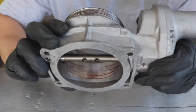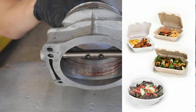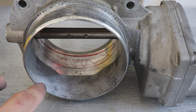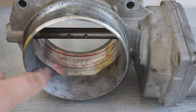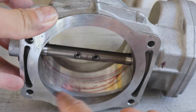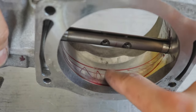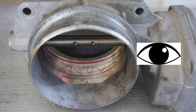Same thing on the top here. Anything in between those lines we can't touch, but anything outside of those two lines we can smooth out with the Dremel. The main areas of concern are these transitions — I can feel by hand that this right here is the biggest transition, and we're basically trying to knock that down, as well as these transitions on this side. Remember to stay out of the red zone, and don't forget to wear safety glasses because you don't want metal flying in your eyes.